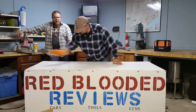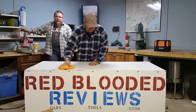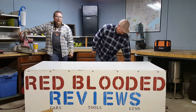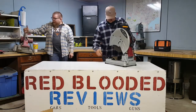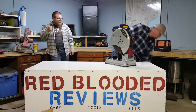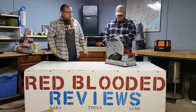You know those little two-stroke generators you get at Harbor Freight — sometimes you get them on sale for 89 bucks. I actually had a few of them and I would run these on them. You had a hard time blowing breakers. You can cut with a small generator. This does pull a lot — 15 amps. The 15 amp part is really just the peak; under full load most of the time you're not going to run more than 8, 9, 10 amps in normal cutting situations.